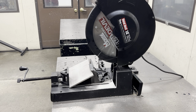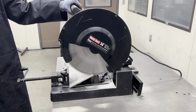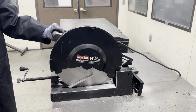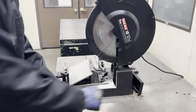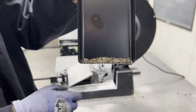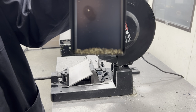So here's what a proper cut should look like. We're cutting six by quarter inch 304 stainless plate. Note, we're minimizing the cross-section by using our V-blocks properly. Go ahead and make one for us, Justin. So you can see here, good surface finish, minimal burr. Notice how the chips are that kind of goldish wheat color. That means most of the heat goes into the chips, which is a good thing. That means we're cutting with the proper cutting forces.